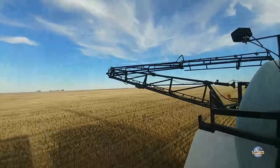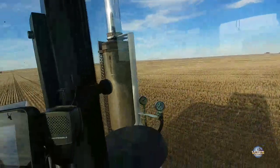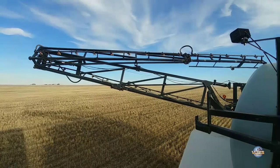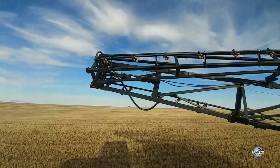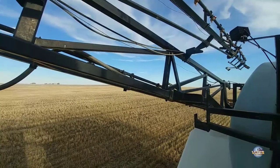So I press the red one. See it coming in? We're running at about 3,000. Oh, wow. We're at 3,500 PSI. Whoa. Yeah, it's a lot higher than it should be. That's why it's going faster. It's got some tuning to do on this thing. It's not perfect yet. We had some issues with the spring sticking inside your hydraulic pump. Yep. And I think we might need to adjust it.